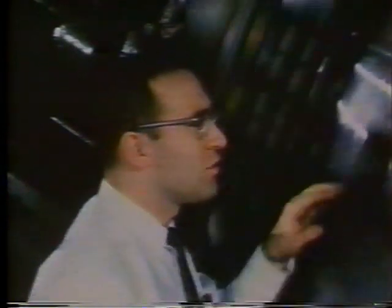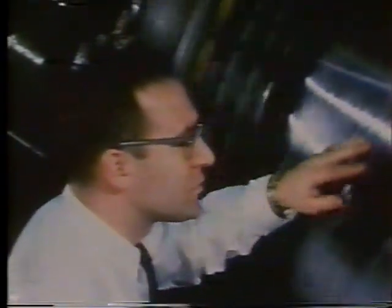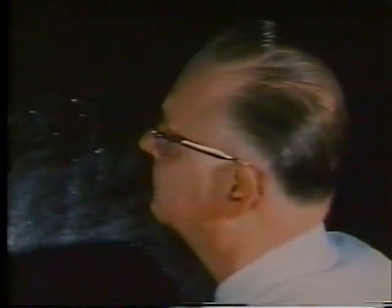The 17.5-foot diameter nickel steel sphere being machined at Westinghouse is the pivot for telescope support and rotation. It is machined from a single casting and is certainly the largest ever poured in 3.5% nickel steel. Unusual tooling was required to machine the sphere to a tolerance of 3/1000ths in both sphericity and circumference. It has a plate glass finish of between 10 and 20 micro-inches.